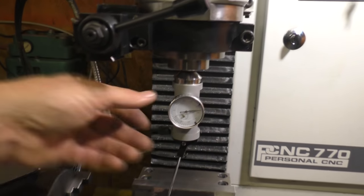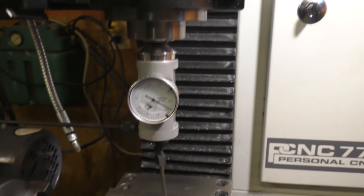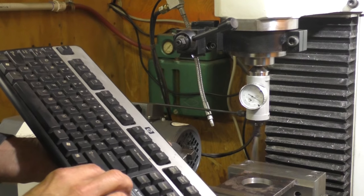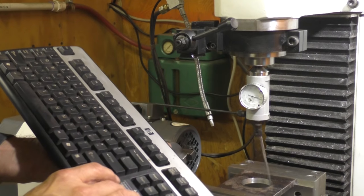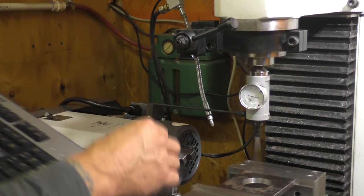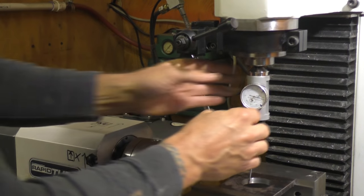And then I'm just using my coolant line to keep the stabilizer arm keeping it spinning and working it by hand because I don't have the nerves to do it right until the needle just moves back and forth a little bit. Now I'll turn it on and finish it off. That's cool. You just move it until it starts getting worse and then try the other direction. All right, that's worse. All right, I'll take that. God, I'm only moving a 1/1000th of an inch every time I hit the button, so that's good enough. Okay, success. Thank you guys, appreciate the help.